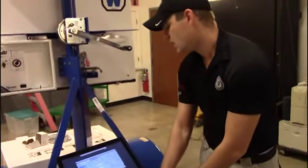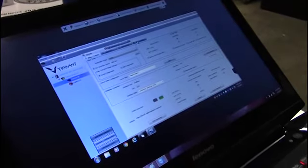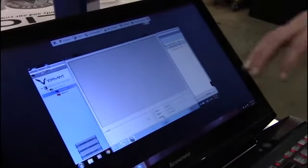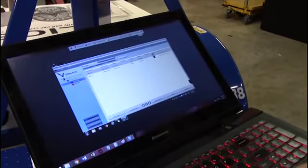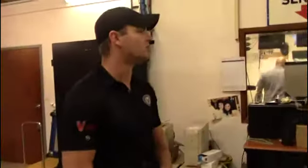As far as checking the GPS: go to the system configuration button on the bottom left again, and you'll see some tabs at the top — basic/com, alarm data, alarm configs, and DSP/camera management. Click DSP camera management, highlight the camera, and there's a little map pinpoint at the bottom center. Click that and verify the GPS location is accurate. If it's not, go to settings on the top left — it'll say 'use GPS device' — uncheck that box, then recheck it to force the GPS to update. If it still doesn't work, call tech support.